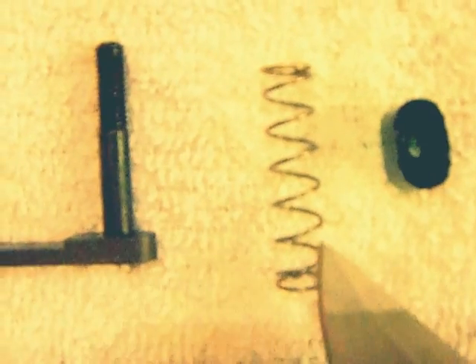This L-shaped piece here is the magazine catch. We have here the magazine catch spring, and we have the magazine catch button. We've got the bolt stop catch. Right here — this is the trigger guard. You see this little thing here sticking out at the end? That is a spring-loaded detent, and I'll show you how that works on the trigger guard. There isn't one here because it uses a pin.